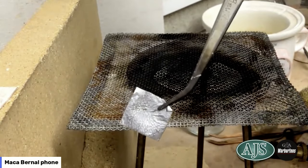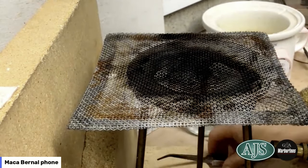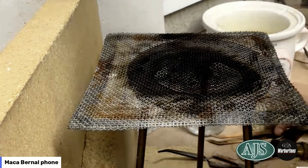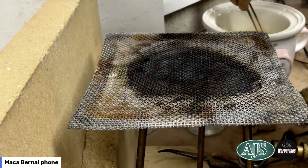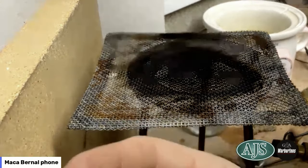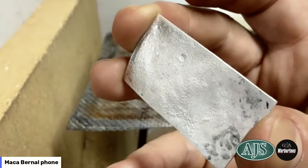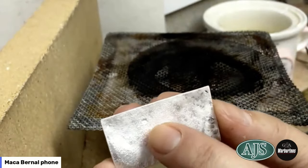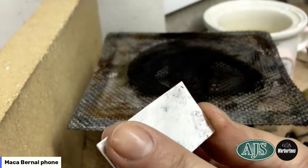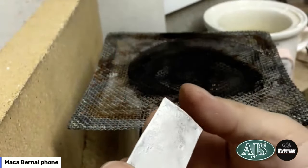There's lovely reticulation there. Red hot — let it sit, wait until it loses its redness. But have a look at how this looks freshly reticulated — beautiful! Into the pickle pot, let it quench. I can show you the one I put in earlier — it's almost like the surface of the moon. If you could feel it with your finger, it almost feels like sandpaper.